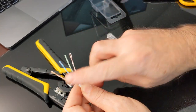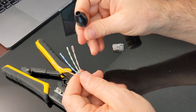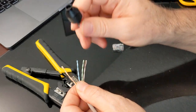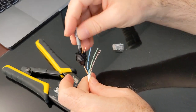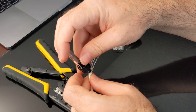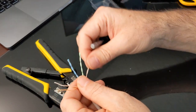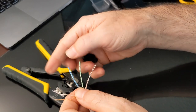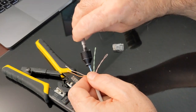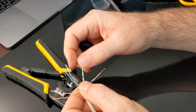Here's where the convenience comes in. We need to have all these wires untwisted and flat before we can put this end on. You take the end and the wire and meet at about a 30-degree angle, then lightly twist the tool. There are little fins inside that find the separation, and as you twist down, they split the wires open. The inventor told me people often want to split the wires apart with their thumbnail first, but you don't need to - it defeats the time-saving purpose. After four or five tries you get the hang of it.